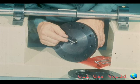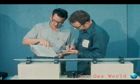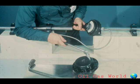Now that your measurements are complete, you are ready to install the couplings. Since the coupling bore is smaller than the outside diameter of the shaft, we will have to heat the coupling so it will expand enough to slide it over the shaft. The amount of heat to be applied can be calculated by referring to reference A in your workbook. This temperature will vary according to the amount of interference of the fit. Your instructor will explain the procedure for you. Check the temperature of the coupling hub during the heating with a pyrometer. Overheating could ruin the coupling.